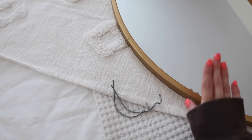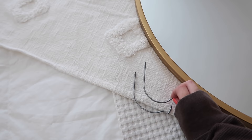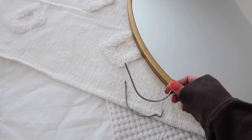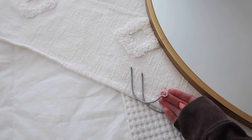Next I'm going to hang up my big round mirror. I've used this in a lot of different places but decided I wanted to put it in here. To hang heavy stuff I really love using monkey hooks. Since this is a mirror and I'm a little nervous about just doing one, I'm going to hang it with two of them. If you've never used a monkey hook, they're so genius - they do minimal damage to the wall and can hold a ton of weight. You just press it into the drywall, it goes back behind the drywall, and the little part that sticks out is only that hook.